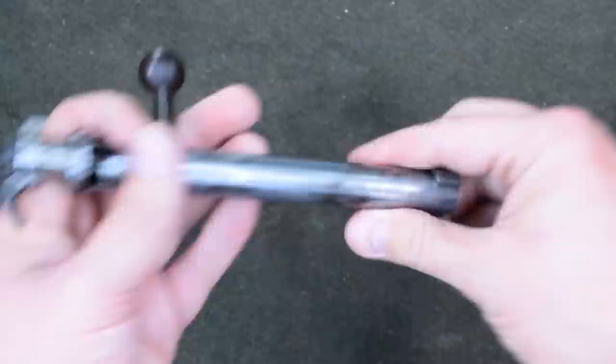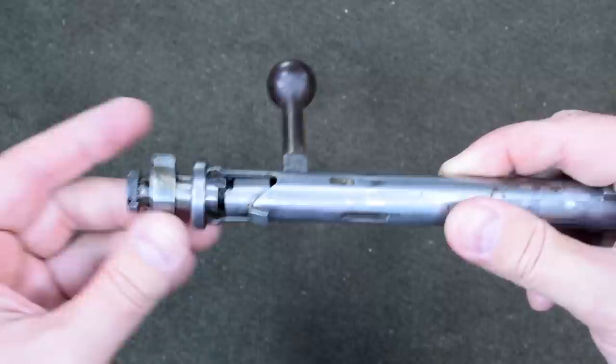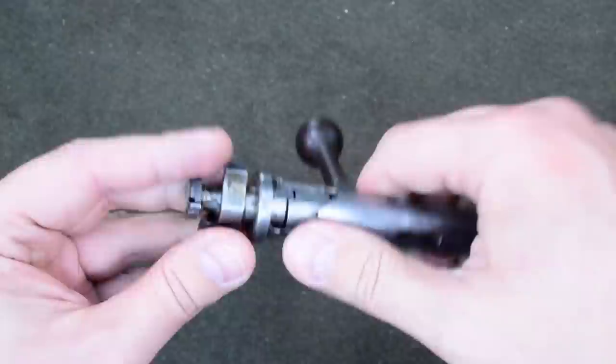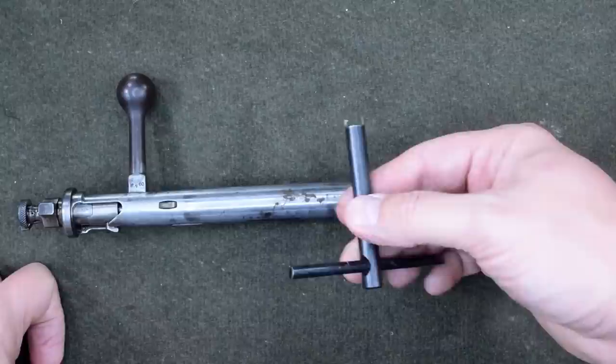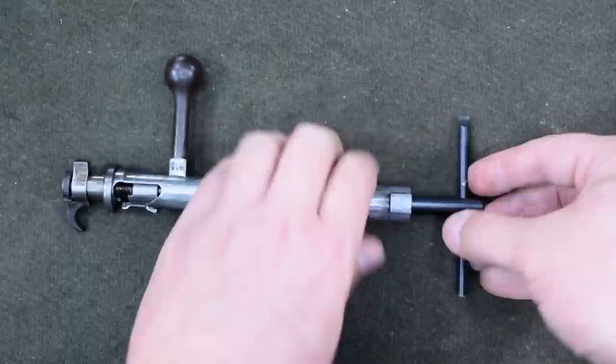That's because we must depress our whole firing pin assembly deeper than we possibly can in order to free that safety mechanism, and that guy's holding on real tight right now. You can't get this sort of puzzle box out of your way without using a separate tool. You're supposed to just have the right diameter of pipe, but I've found that Lee Enfield bolt head tools work perfectly for this task. They wrap around the firing pin and provide just the right dimensions to be able to push this guy up and down the way we want.